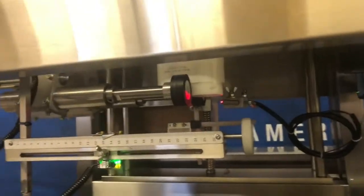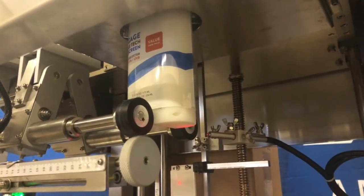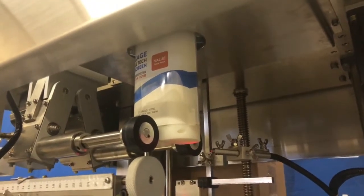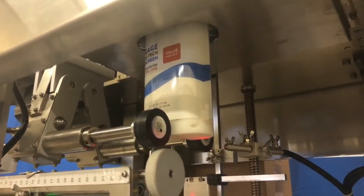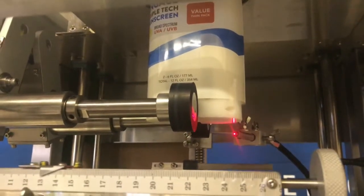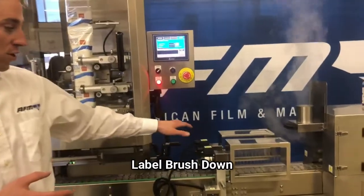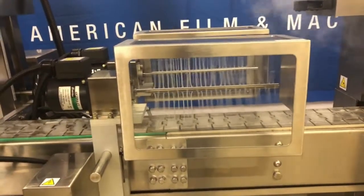You can see that the label has already been cut — it's sitting there waiting to be introduced to the drive wheels, and that introduction is facilitated by the next impression coming down. Pressure is applied from the top, the drive wheels spit that label out, and we are hitting a moving target on the fly. We've got photo-eye registration to account for the container coming through and maximize timing. From there, the final included feature is our label brush down, which ensures the label is in the correct position, sitting flush to the conveyor for a perfect shrink as it goes through the tunnel.